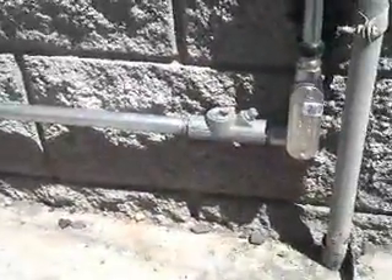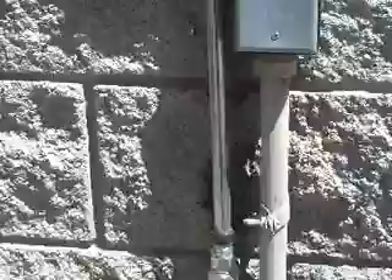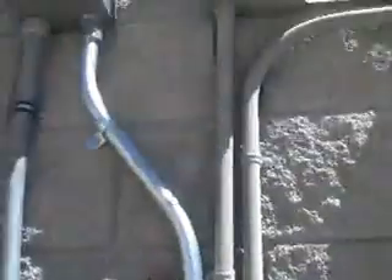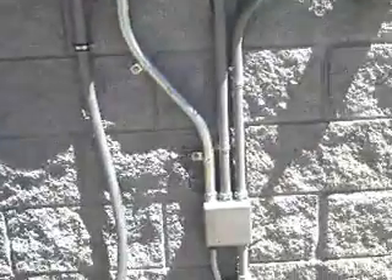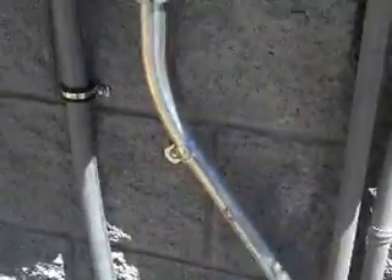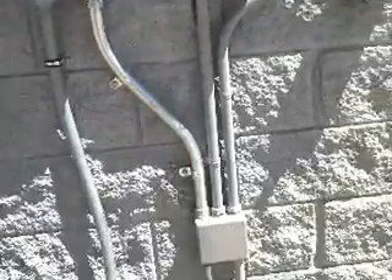I'll follow this wall. It runs back — we ran it all the way back up and along here behind this pressure washer, and runs back over here. That's the end of our explosion-proof seal-off zone. From there we switched over to just exterior-rated conduit and run up into this box where you can see that extra piece.